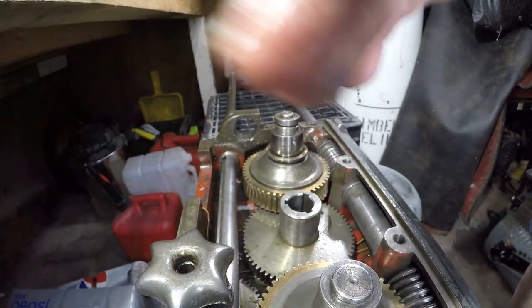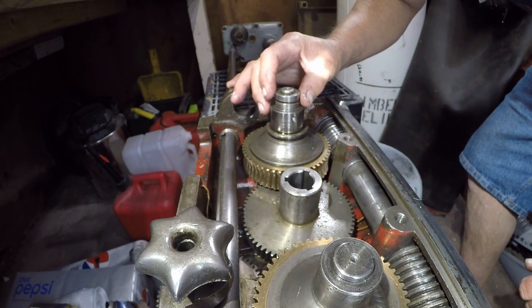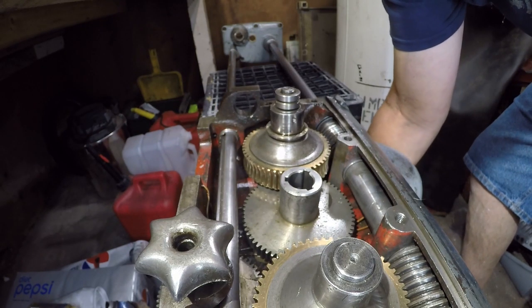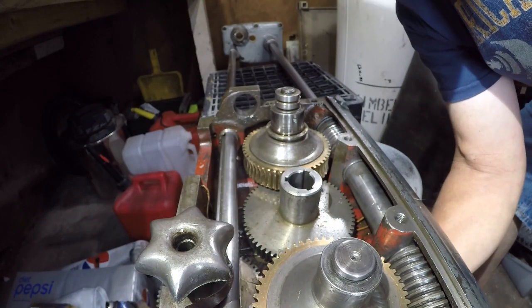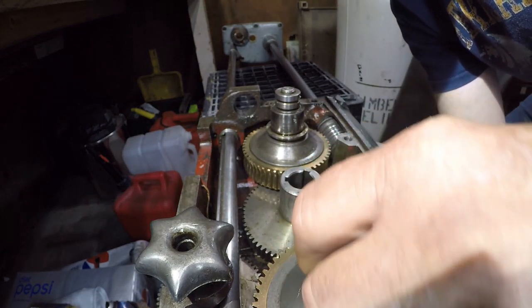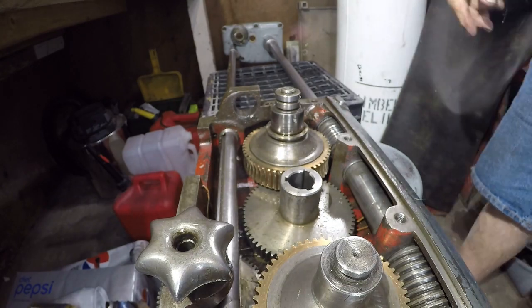It does have an issue. When I'm turning the knob down here, this cone is being sucked down. Turning the other way — counterclockwise — raises it up via the rod threads. There's a lot of travel on this working one, but on the problem one I don't have as much travel, and when I disengage it, it doesn't always want to let go. I'm not getting full travel in either direction.